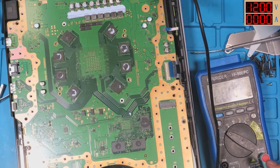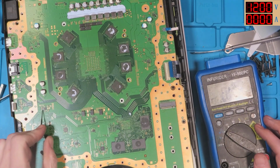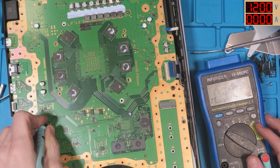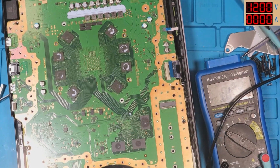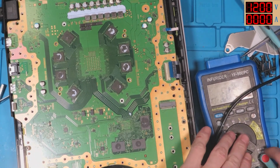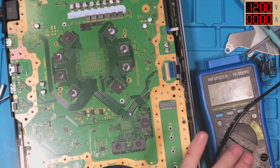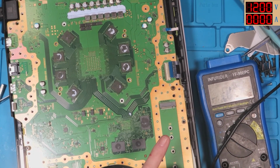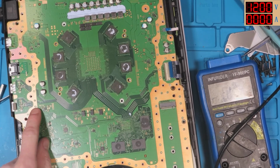Diode readings are quicker. So let's pop red probe on ground. Oh shit. And that is actually... Oh no, 0.37. But we have still got something different on this. I could potentially... That is actually a good idea, Bob. I could potentially... Because we have got 3.3 volts, I could inject 3.3 volts and just see if it turns on. And if it does, then I've narrowed it down.